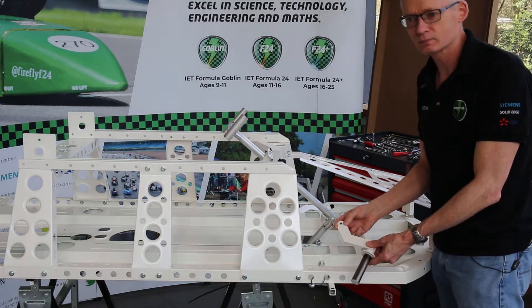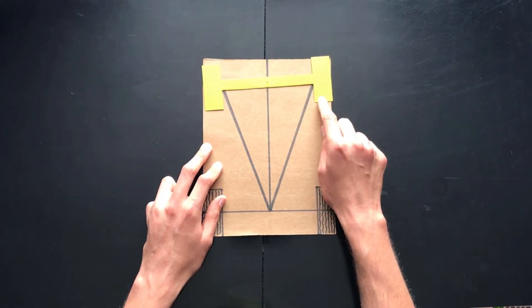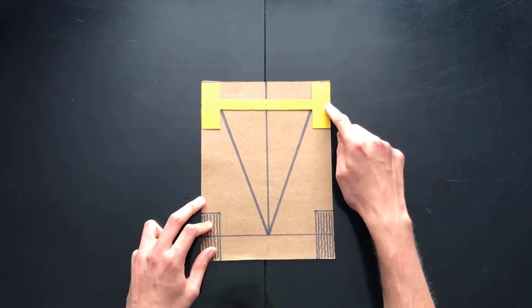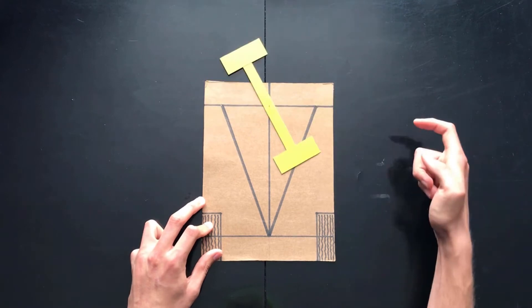I don't know if Gav can tell us why that kink is there. I can certainly try, but first I need to take us back to the old horse-drawn carriage. Their steering system used to have a central pivot on their front axle. This is a really simple design and at low speeds it's brilliant as it gives you a lot of manoeuvrability. But at high speeds this steering setup becomes unstable, because there's a long lever acting on the pivot. So if the wheel was to hit a rock or something, the steering could get knocked out and the carriage could tip over. And that's exactly how the story goes — one day a designer was travelling in a carriage that tipped over and they were injured, motivating them to come up with a better solution.